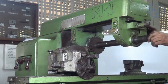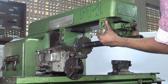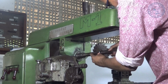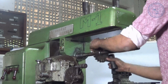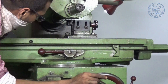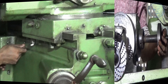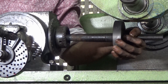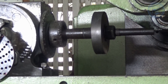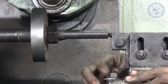After selecting the indexing procedure we move on to tool setting. The intention is to fit the DP cutter — remove the arbor support, collars and existing milling cutter, then insert the DP cutter, collars, and refix the arbor support. By adjusting the saddle, align the tool and tailstock properly, then lock the saddle. Next, fix the index plate with 19 holes in the dividing head. Insert the tapered end of the mandrel with the workpiece into the headstock of the dividing head. Align the other end of the mandrel with the tailstock and tighten the screws.